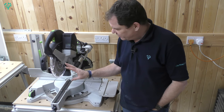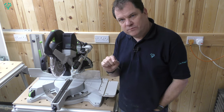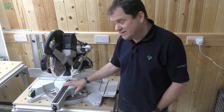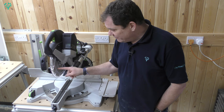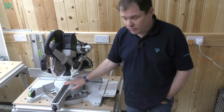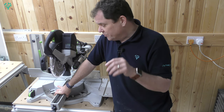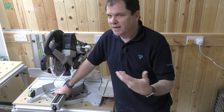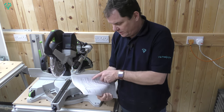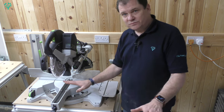You can also adjust the calibration of the bevel cut and the calibration of the mitre cut. Those do come factory calibrated. The lasers can obviously move during transit, so that's something we need to maintain and watch, and the position of the lasers is personal choice. The bevel cut and mitre cut are preset and configured in the factory, so they come pretty much bang on — and the tests I've done on this confirm that. What Festool says is, as part of your maintenance routine, check that frequently — especially if you haven't locked this down for transportation, it can get knocked and the calibration can adjust. In the manual I've advised you to download from the Festool website, it talks you through that. That's perfectly set up so I'm going to leave well alone.